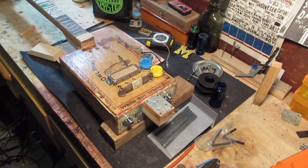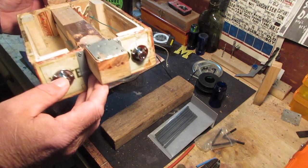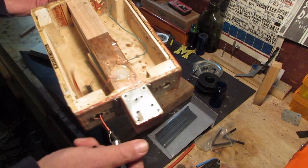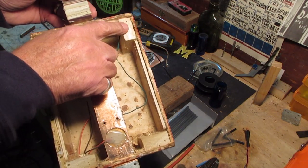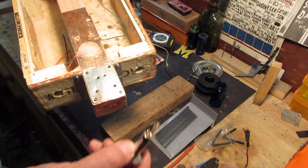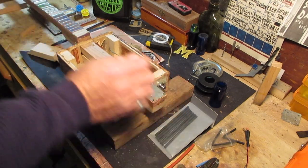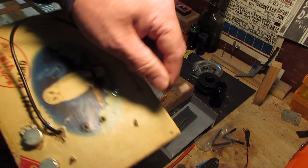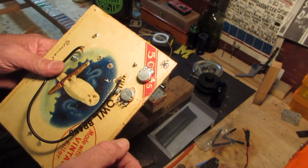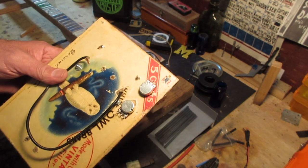Alright, last one off. Let's open this up. Remember, in the last couple of episodes I told you I was going to put two different jacks here. When I beefed up the box, I put these pillar blocks up at the front - but back here I had to put them in this way so they would accept the jack. There's going to be a jack running here, connected to this coil right here. I've got the wires run down here and the volume pots right here. I'm going to take these off, bend them over, and then solder everything up.